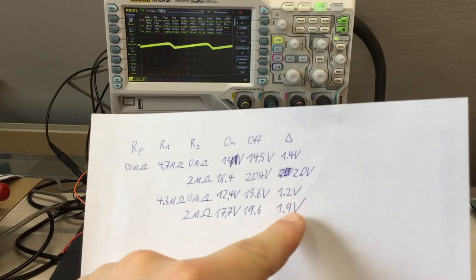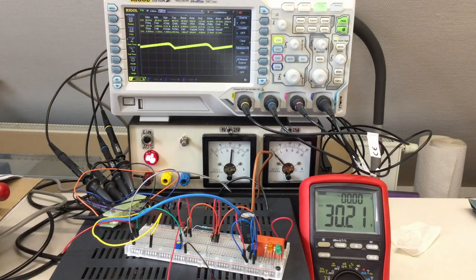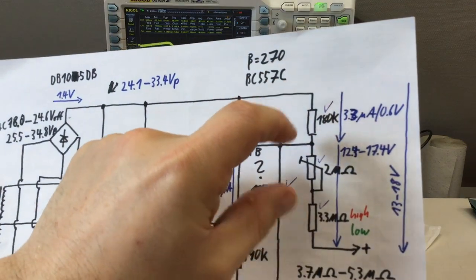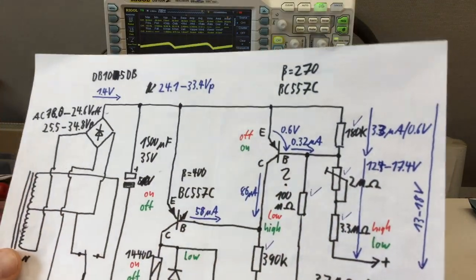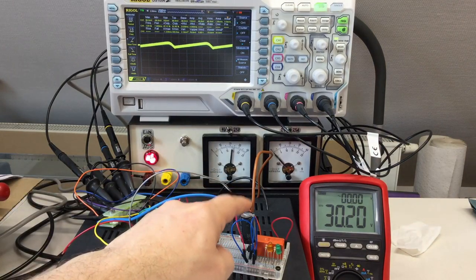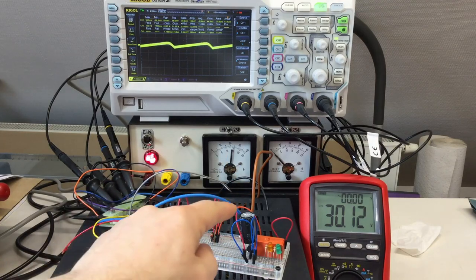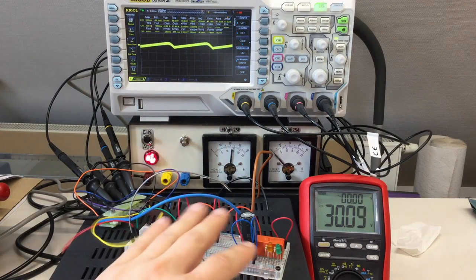So if I have, let's say, 300 or 400 millivolt ripple here on my positive rail, which is of course also rippling, then the delta voltage here across my voltage divider, that doesn't matter. So I wonder how small I can make that. And, yeah, that's me coupling in. I wonder how small I can make this capacitor without blowing up the whole thing. That is, it won't blow up, but it would stop working.